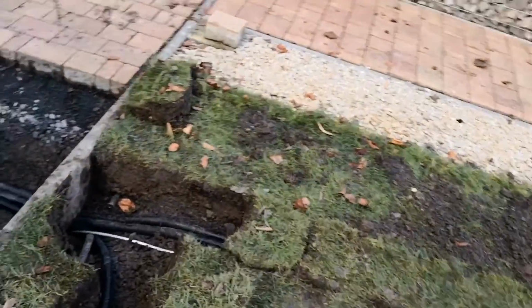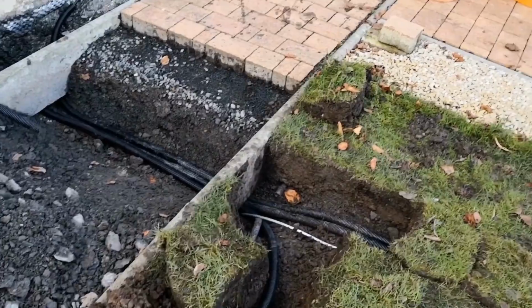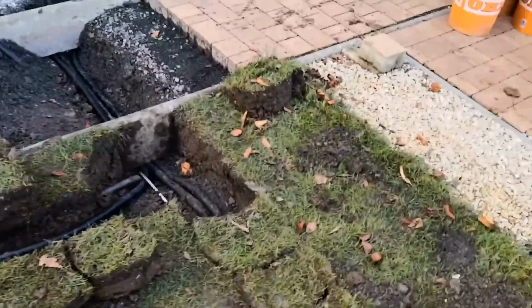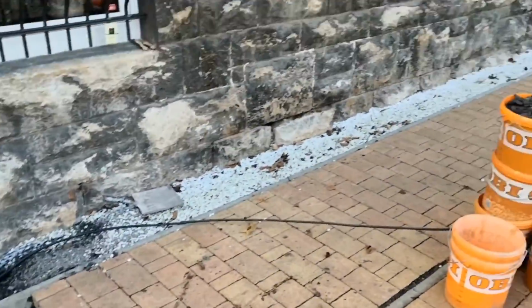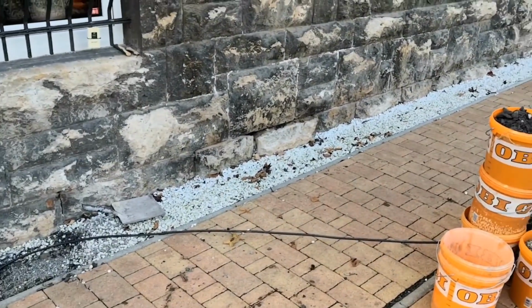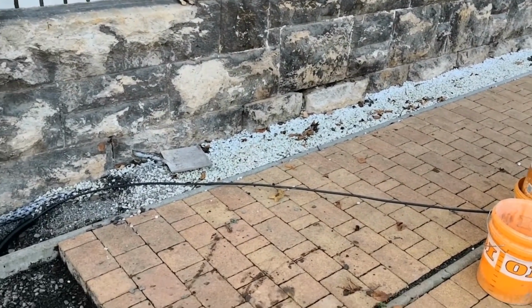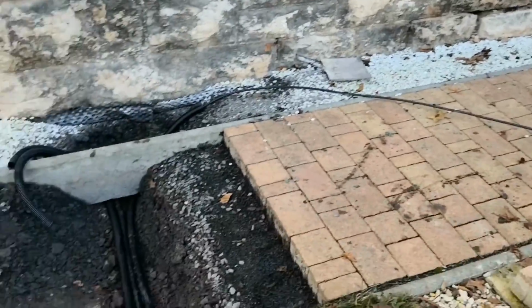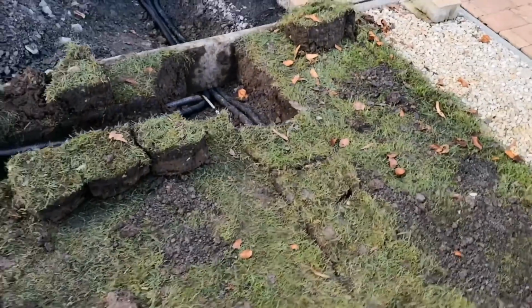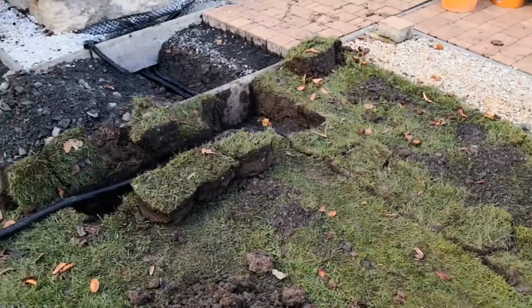I just really need the water pipes. The mail has not arrived yet. I still have to wait 2 hours. I took the time to lay my underground cable, or rather the potential cable, under my gravel along the house wall and connect it to my existing grounding electrode. Then I at least improved the grounding function, as it was recommended to me, and I can complete the sub-project.